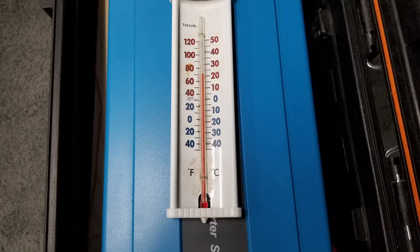I did have one concern with the inverter inside and no fans. It is capable of running at 2000 watts, but I only plan to use it for relatively light loads up to about 200 watts for everyday cycling. So I tested it at 1100 watts for one hour. The temperature got up to about 105 degrees, which is no problem. I also ran it at about 200 watts for over 24 hours and it never got over 85 degrees. If I ever have to run it at a higher wattage for long periods of time, I simply need to open the lid to keep the inverter cool.